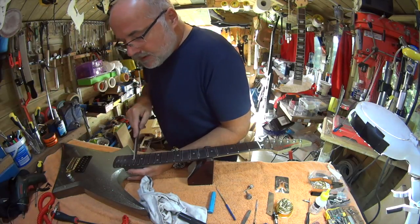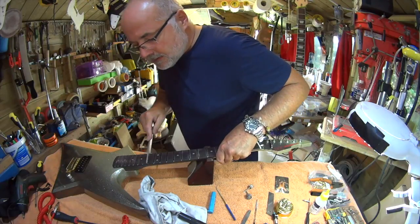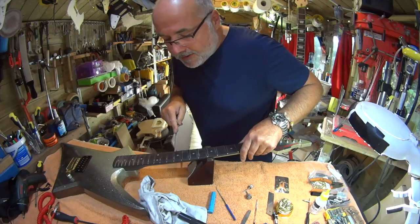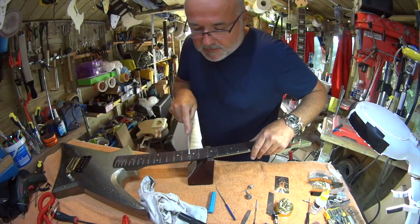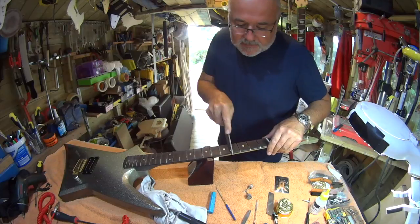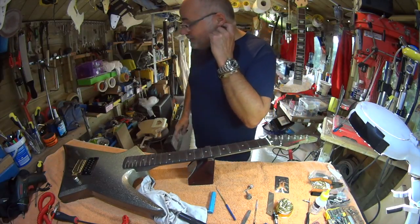It's very close. A couple of spots where it's flattened at all. A good indicator of how little you've actually done in terms of levelling is how quick you can go across this part without having to stop and work the spot. And this is really flying through, so despite what it may have looked like, there's hardly any material removed. A little bit on these far edges, a bit on this front edge. But that is that done.